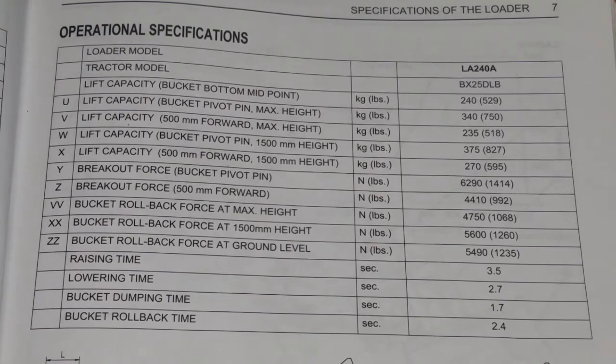With those clamp-on forks, it seems like it's going to set the load out at least another four inches or so, meaning you are losing an additional — what's that — about 48 to 52-ish pounds, just going out that additional four inches.